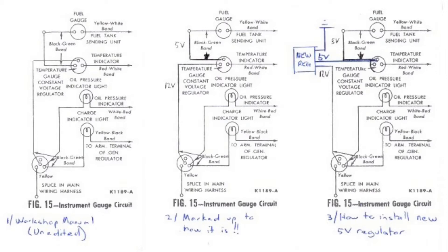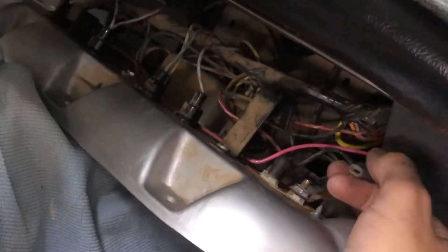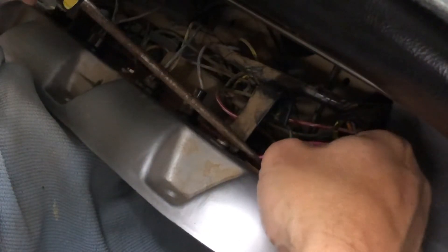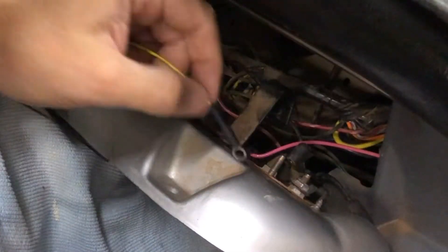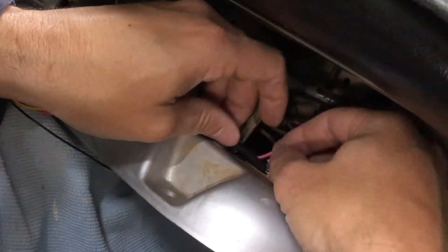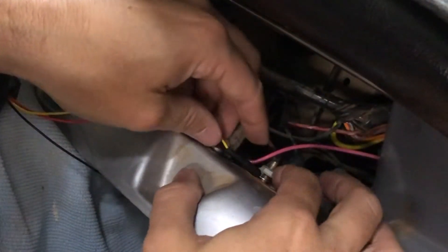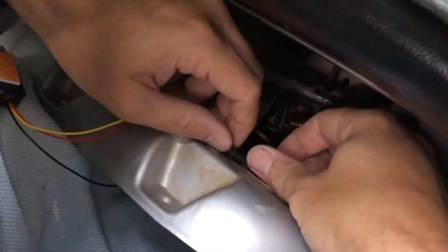On the right hand side you can see the modification I intend to do today to install the new voltage regulator. For safety I've just re-disconnected the battery. We'll get this main power feed off — that's the main 12 volts coming in — then we're going to take this connector off as well, that's our five volt output. When we tested earlier the yellow was clearly the five volt output, so we're going to connect that back under there. That's not going to work, so let's come up with another way to do that.